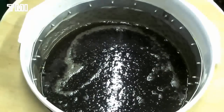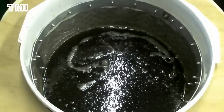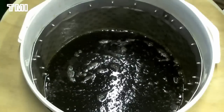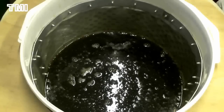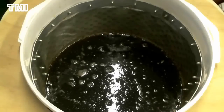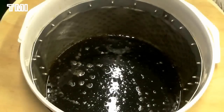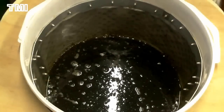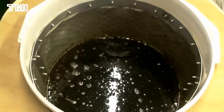So there you go — this is cold filtering. We don't want to waste money heating it, but we want to catch all those tiny little bits. So that when we come to test our oil, or if you're using this oil to run straight in your vehicle fuel, this filter is finer than your fuel filter. You can start to see the bits at the top. We're near enough filtered — we're up to 35 litres and we're only at just two and a half minutes. I'm going to give you a good close-up camera shot so you can see all the bits on the side — this is what will block your filter socks or filter bags if you use them.